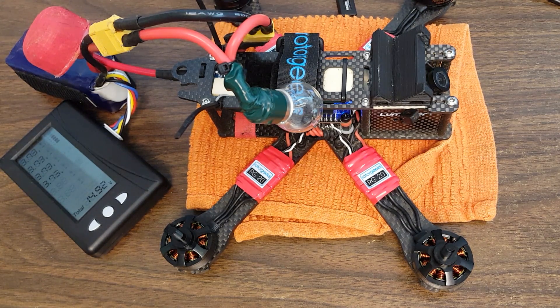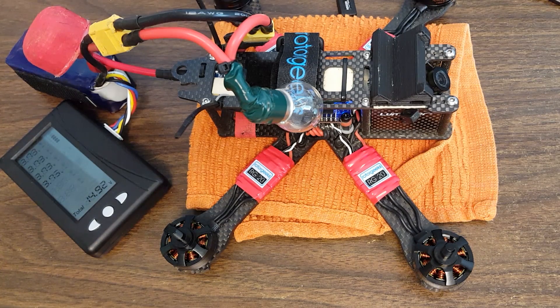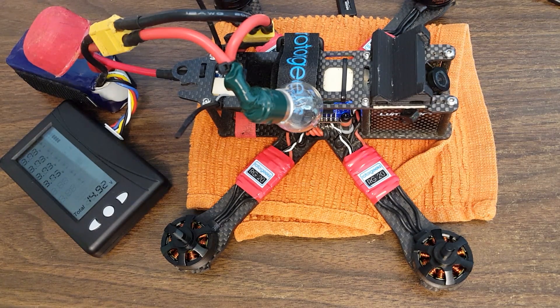To get it all in one phrase: more vibration bad, less vibration good. But there isn't really an absolute amount of vibration you could point to and say that's clearly too much. You could have a copter with a lot of vibration, tune it a little looser, filter it a little heavier, and it could still be perfectly flyable depending on your standards. There's a gray area.